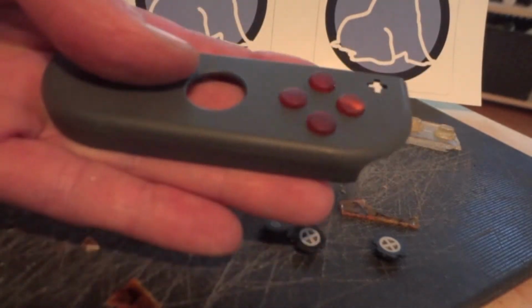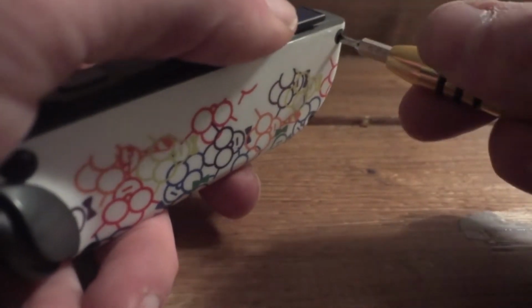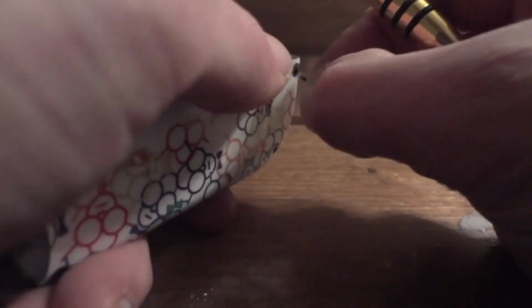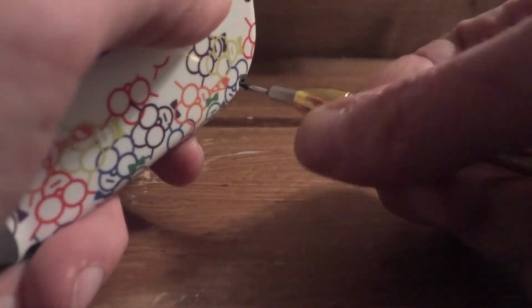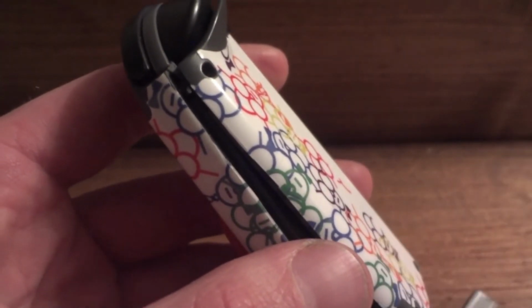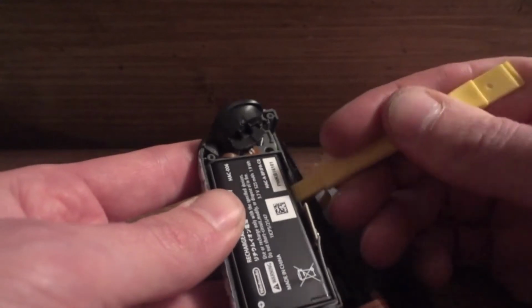And now to put these in a working Joy-Con, I've got my custom skinned Rube Joy-Con right here. So we're gonna pull this apart real quick. If you're looking for a tutorial on how to pull these apart, I'll link the one I used. I'm not gonna attempt to try and make a better one because that one was really good. Taught me a lot. But just be careful, have a little place to store all your screws so you don't lose any, and just be patient with this. Everything is tiny in here, so it's very easy to lose stuff or break stuff if you're rough with it. So just be gentle. There's only a couple pieces that are adhered on, and they are the battery and the rumble pack. So those are the only 2 things that you have to use a little bit of force to get off.